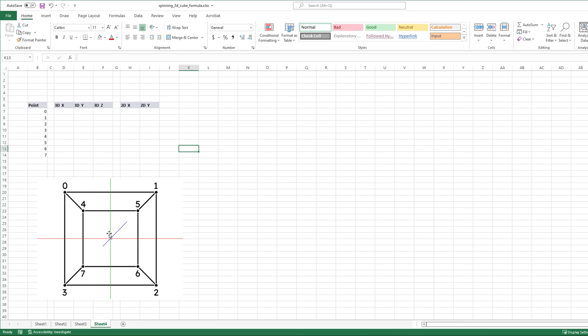The same code running on Arduino looks great, but it's not very fast — the limiting factor is the I2C connection, not the Arduino itself. Enabling the fast I2C option in the emulator shows it running much faster. Alternatively, you can use a different display with an SPI connection — for example, a physically very different display that still uses the SSD1306 chip with 128×64 resolution. With SPI you get much smoother animation. One thing I haven't covered is drawing dotted lines for invisible faces — if there's enough interest I might record a second video for that. If you liked this video, please check out my other videos, and thank you for watching!